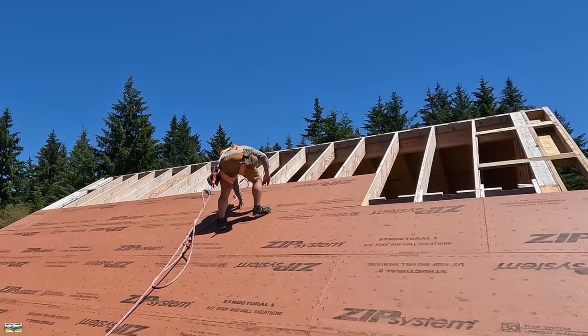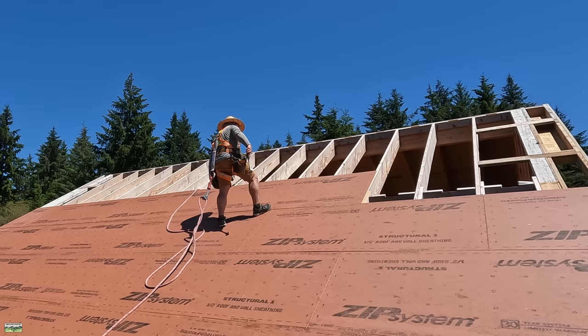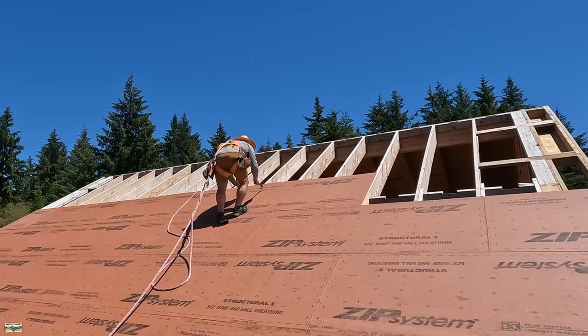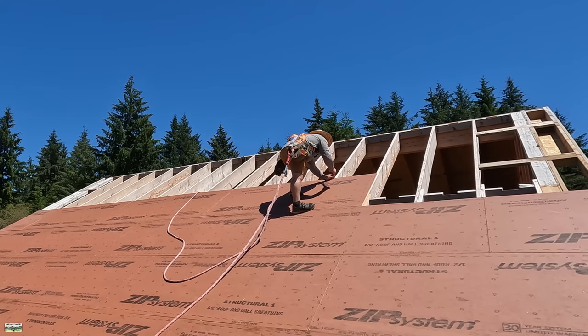You can tell this is a 7/12 roof — well, actually a little less. Earlier in this video you could see we had rafters over the vaulted living room going from the lower floor up to the second floor where those blocks are. I had to calculate the run and the rise to make sure the rafters landed right on that wall, which gave us a 29.16-degree slope. I just rounded up and call it a 7/12.